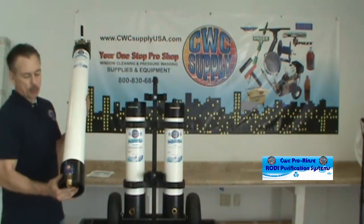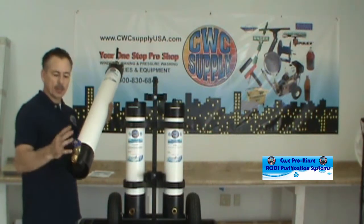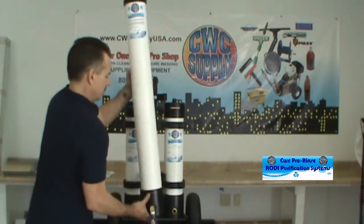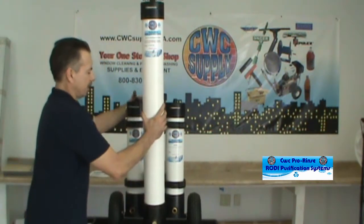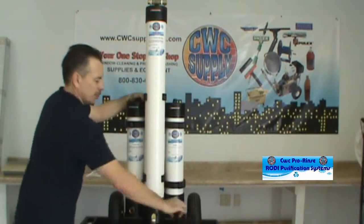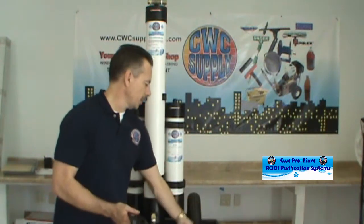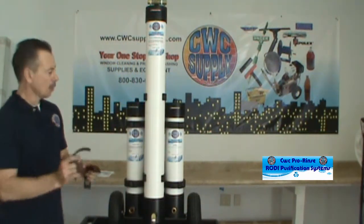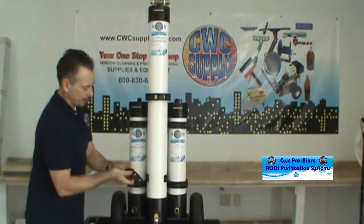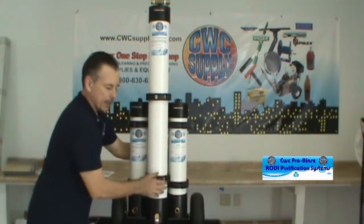The first step is to install this valve. It will be disconnected — simply screw that on and get it in the same configuration you see here. This filter is now ready to put into place. Simply set this right on the T of the rack and push it right into the two black C-clamps. Also included will be the two retaining clips for the RO. Once you get the RO in, simply take these clamp assemblies and they will lock in place, keeping your RO membrane in place.